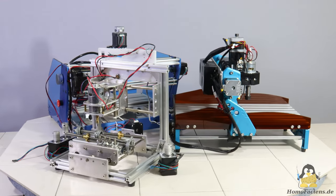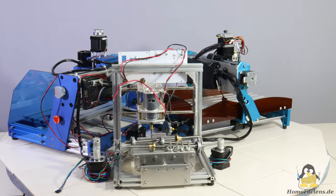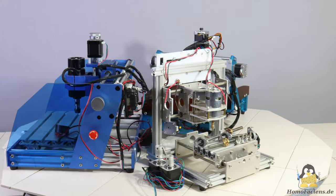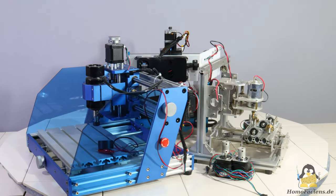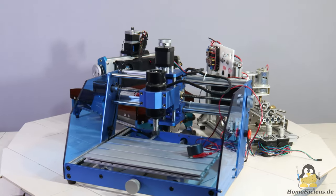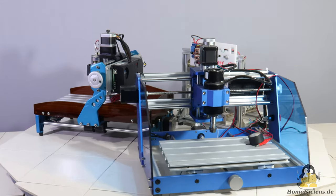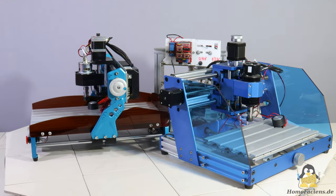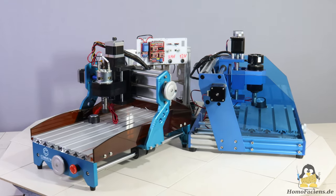In this video I would like to bring you closer to my passion for inexpensive CNC machines. There are countless variants on the market, from very cheap and very simple to slightly more expensive and more robust looking. The machines I'm referring to use an unmodified Grbl as firmware, running on an ATmega328P microprocessor. The affordable price, the well-documented microcontroller and the open source firmware all make these devices a great platform for learning machine control and performing hardware or software hacks.